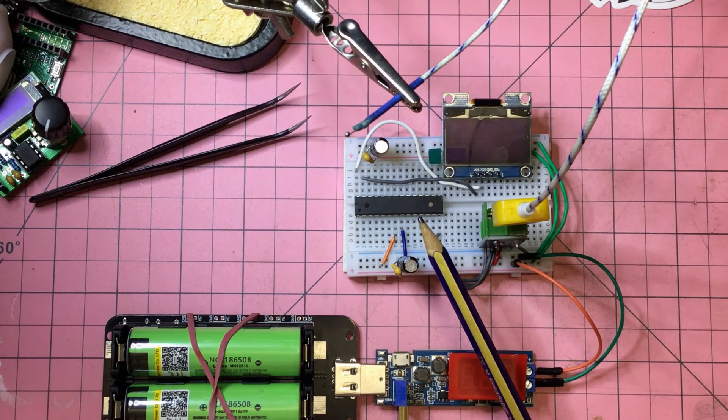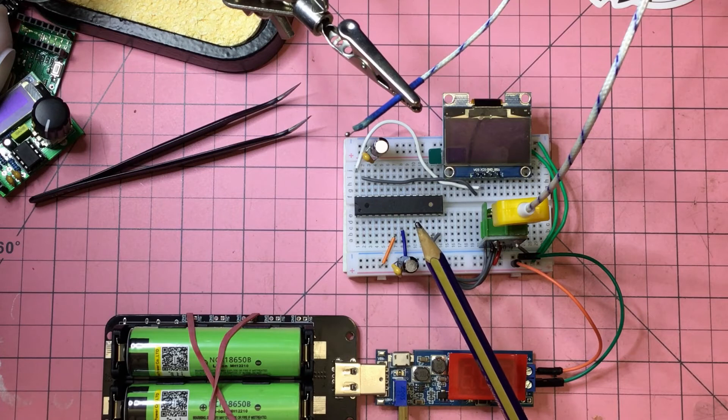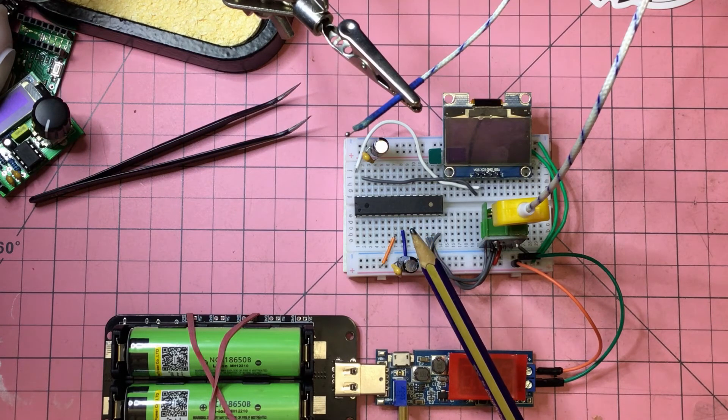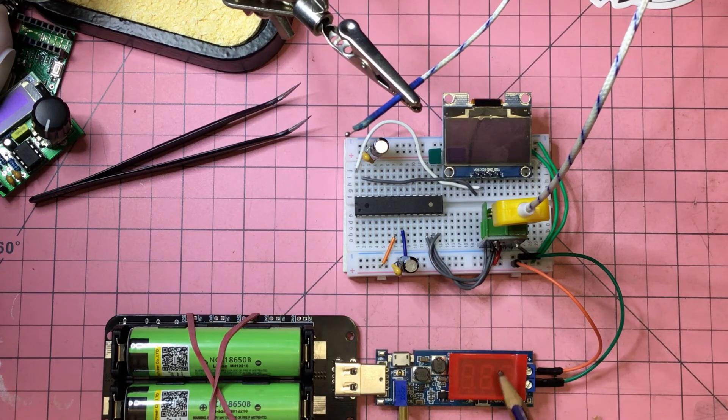Even with the ATmega 328P in there now, it's already half full just with the monitoring we're doing. The ATmega 8A was the original chip in the Uno, so I was hoping to recreate that. There's a fork in the road - you could write routines yourself, dip into assembler, choose smaller libraries - but you'd probably hit the same problem when you add the control side, because right now this is just the measuring side.